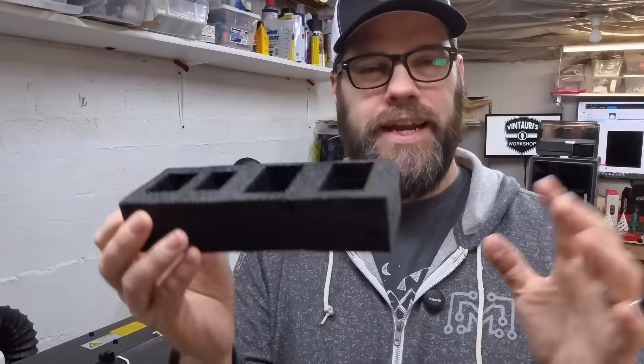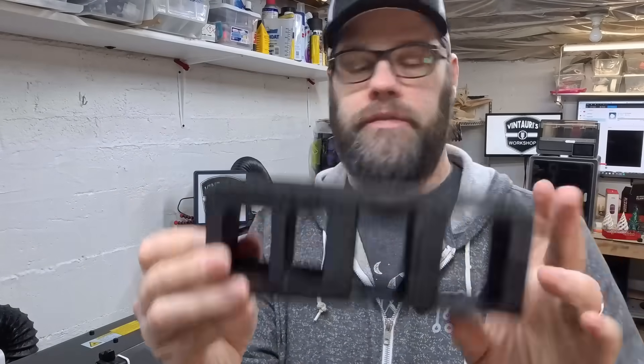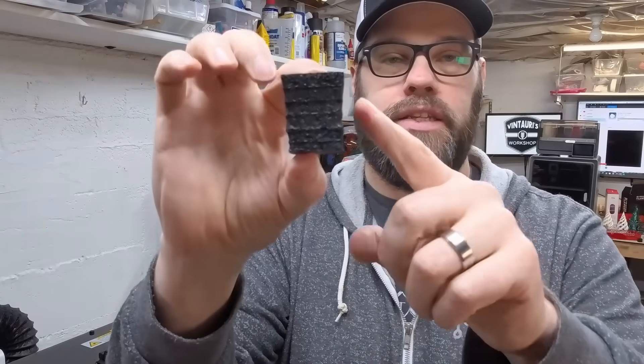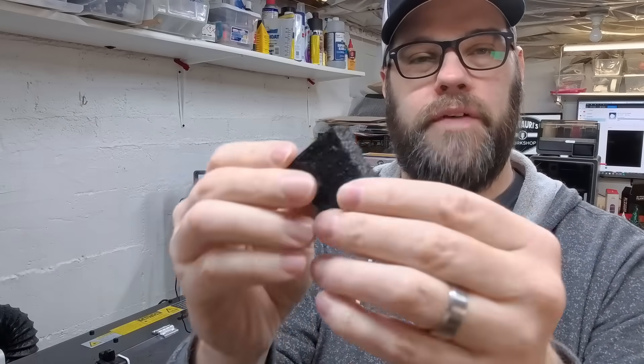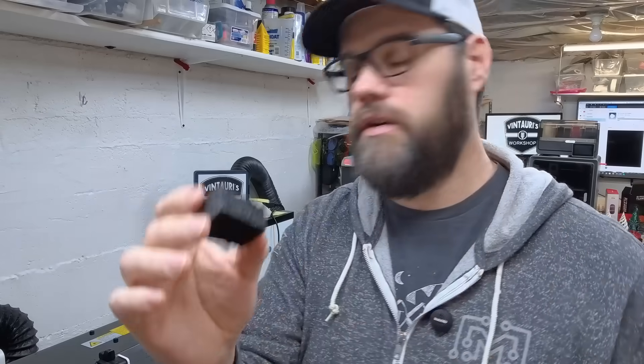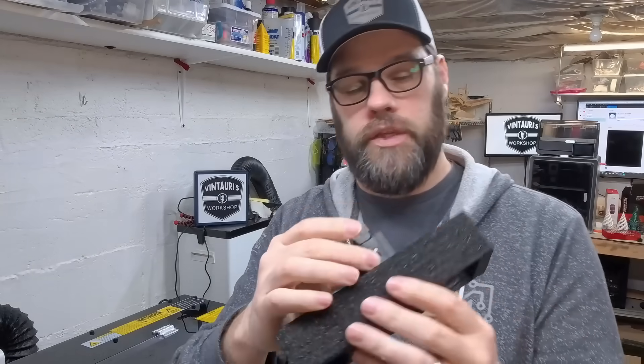The first one did cut out — I had to go two passes to get it to work. The top looks really nice, the bottom not too bad, but you can see it gets a little rough and the cutout does angle in as it cuts through — that's due to the hourglass shape of the beam. I wouldn't want to go much slower; speed is your friend here to keep it fairly clean. But what I'm noticing is that it's too loose — I want a little bit of friction on these, so I'm going to scale these in about 10 to 12 percent and rerun it.